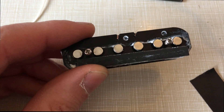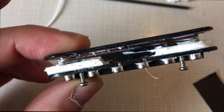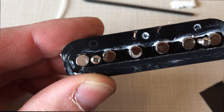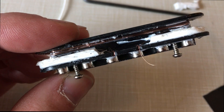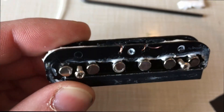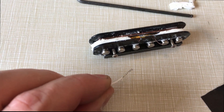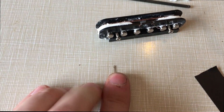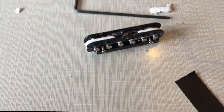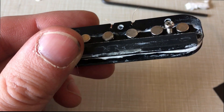You're going to drill a couple of holes in the pickup and put a couple of notches in it with a file next to the holes. Then wind this pickup like any other single coil would be wound — start the winding on one hole and notch, wrap it around a bunch of times, and end the windings on another hole with a notch next to it. I tried soldering insulated leads onto the enameled wire before winding, but there was too much strain on that solder joint and I kept breaking it — don't bother trying that way.